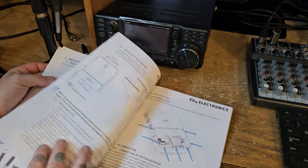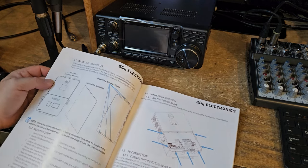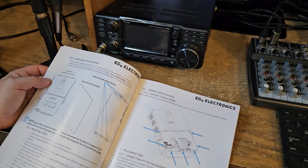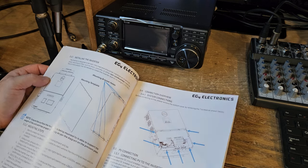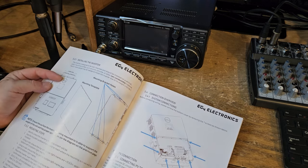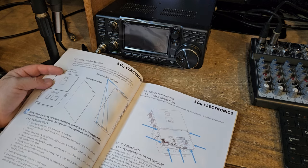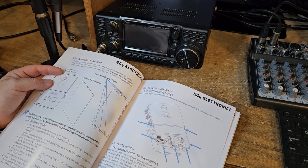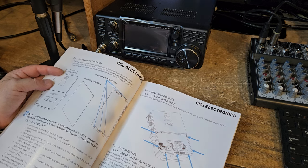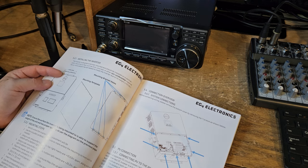Okay. Goes into some more stuff here. This is a very, very thorough deal. Mounting template. PV connection, so they gave you the mounting steps. Install a separate DC breaker isolator between the inverter and the PV modules. I thought it had a breaker, but I guess it doesn't.